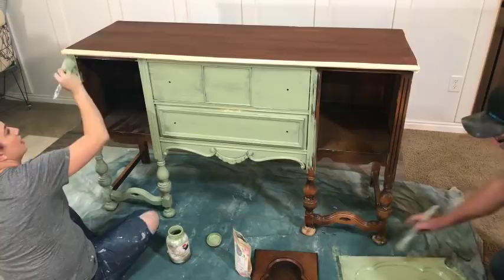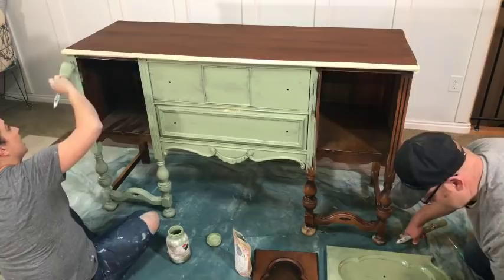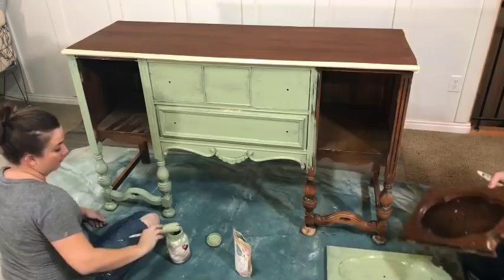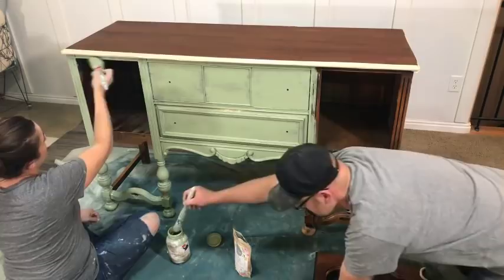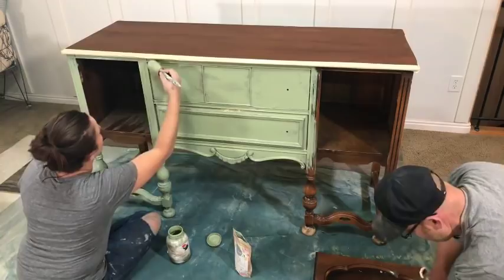The stripper will help, but you're still probably going to have to sand. If it's solid wood, bust out the belt sander. I did a video where we verified it was solid wood and belt-sanded it in the direction of the grain — that's very important. We went from low grit to high grit and got a beautiful finish. When I first started, I thought I was all the way down through the grain, but then I'd put a damp rag over it and see shiny spots. You just have to be careful.